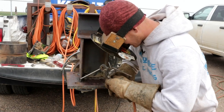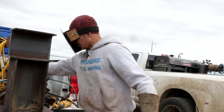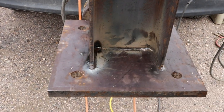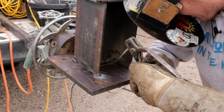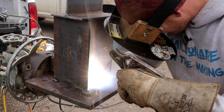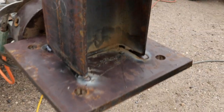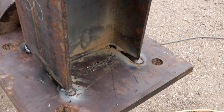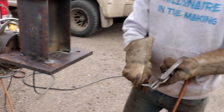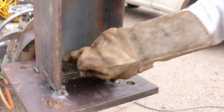Since we've got to catch this outside, we start out here and wrap ourselves around and come to the inside. Now if you look at the inside right here, we might have gotten a couple more BBs — one right there, a couple just sitting around, but not too many. So now we're going to start from the inside. As you can see, we've got quite a few more BBs because we started from the inside and worked our way out. That has to do with not only the angle we're working with, but also the fact that you can't really see everything going on with your puddle on the inside. So the tip of the day: start from the outside and work your way in.